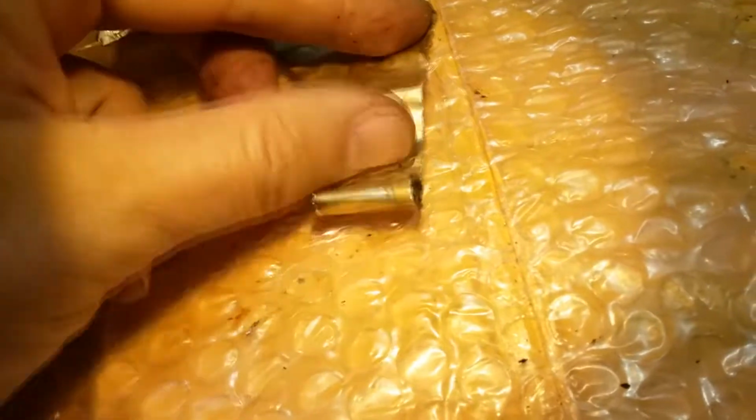And, you know, it keeps rolling. It's just two of them rolled together. And you see, it's hard for me. You can get it closer to the light. And you see, it just keeps rolling. It's just two foils with wax paper on both sides. And there's the end cap. On the inside one, at the very inside edge, one of the aluminum foils connects to a lead. And on the very outside edge, the other one connects to a lead. So it's like two long plates, right? With an isolation between them. That's what a capacitor is.